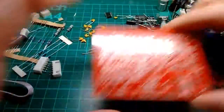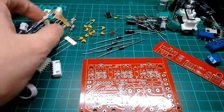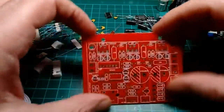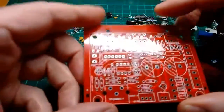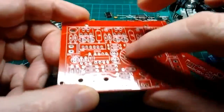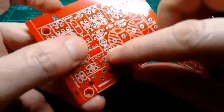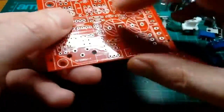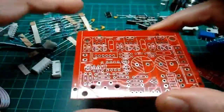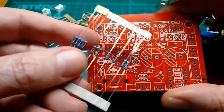Once you've got all your bits identified you probably want to start to put some bits together. There's lots of people who do it lots of different ways on the internet and YouTube videos, but I think the best way is to approach it from the perspective of what is your accessibility level to the components you put on. If you put big things on they're going to be in the way of smaller things you want to get in around the side of them. So if you start from the bottom and work your way up, a lot of people say you'll work from a good angle, and the most sensible thing to start with are the resistors.